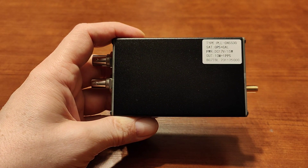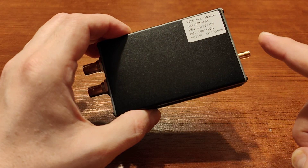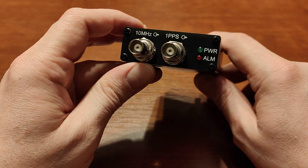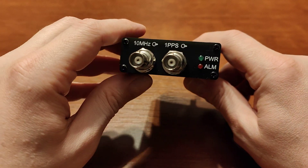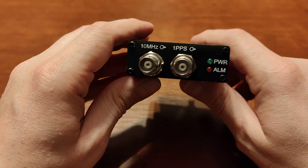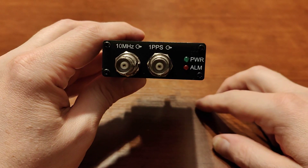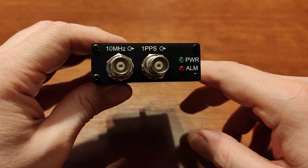When I was using this with my Gustard, I did not connect the antenna because the precision was good enough. The antenna is for correcting the clock if the internal generator is missing some beats — going too fast or too slow. But you need to remember that at a scale of 10 MHz, these are minuscule differences. They may be important in radio astronomy where you have to be as accurate as possible, and you can use GPS to correct your signal, but for audio equipment it doesn't really matter. I'll pause for a quick magic unscrewing and show you what's inside.